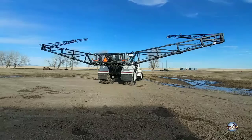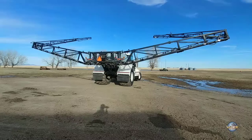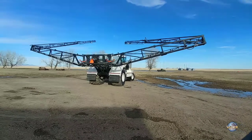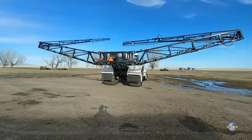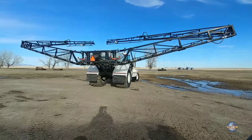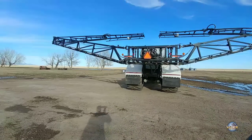We were real fortunate too. We had some worries about the hydraulics. We were having issues with the pressure staying correct at around 2,800 to 3,000 PSI. It's a little high, but we kind of like it there because it means faster boom control. But it wasn't getting there, and we found out we had some issues with some standby pressure on the pump. So we fixed that, and then we had some plumbing issues with the way the hydraulic water pump works.